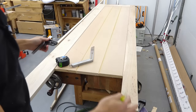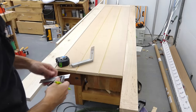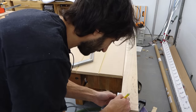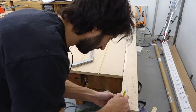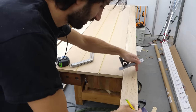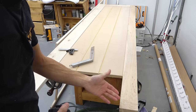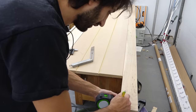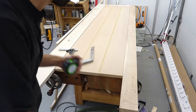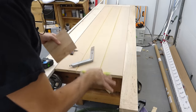I already know that this area of the floor is lower, so I'll probably be down into this a little further than on all the other ones, but I'm just gonna draw it at that half inch, assuming it all gets removed. So in theory, that would be the actual finished bottom of the cabinet. And basically that's touching the floor in theory. It's getting me back down here somewhere because the floor dips, but I'm just gonna lay it out like that for now. Right here is where the steps are.